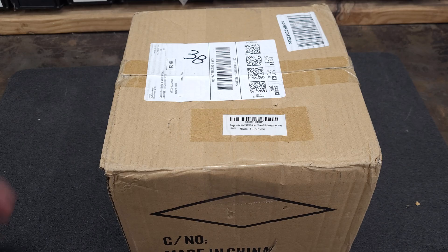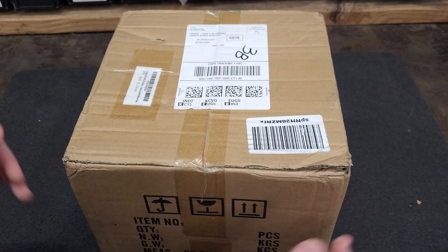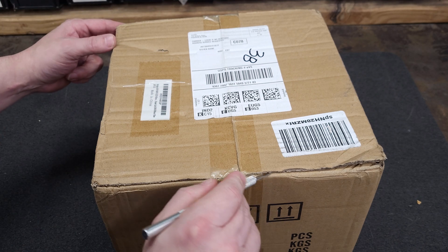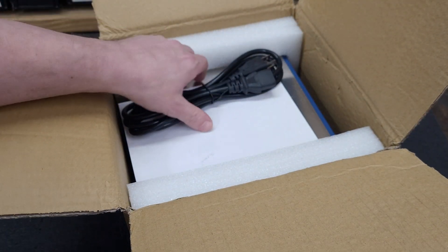Hey everyone, this is a little mail call. It's Monday — I ran into a situation where my little tiny preheater got overworked and died. I ended up getting a ceramic hybrid circuit board — I think it's an aluminum nitride board — and it requires a lot of heat. The thermal conductivity means you hit the solder pad and the heat's gone immediately; you can't even melt solder on it. My little preheater didn't work, and I didn't want to grow a third arm trying to hold hot air underneath the device, so I picked this up.